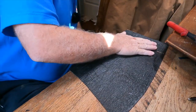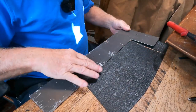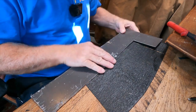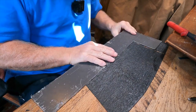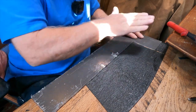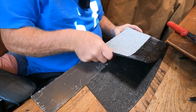Once you've got your peel and stick rolled out, you put your metal drip edge over it like that. As I explained, you put your tar in between the seam so it doesn't leak, and you nail this with three-inch nails into your roof. Once you've got that done, then you put your cap sheet over.